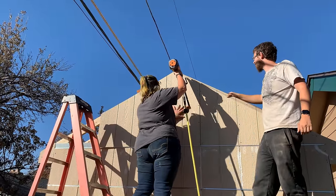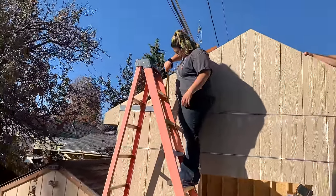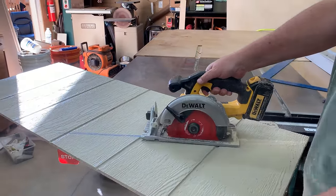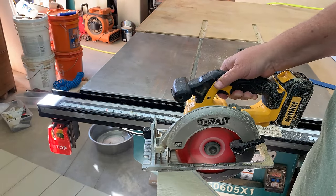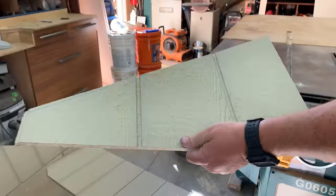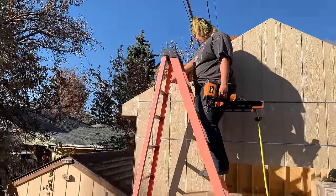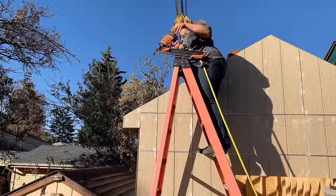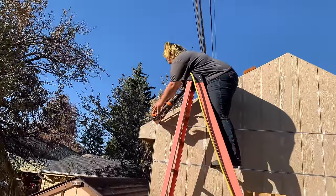Then we'll just install this piece with the same nailing schedule as before. Now that we've reached the other end, it's the same situation — two elevations, one attaching to the siding and one at the other side. We'll transfer those measurements to our board, take it inside, cut it, and put it up. I hope going over all these things in detail wasn't too boring — I wanted to point out the techniques because measuring to get these cuts to line up can be a little intimidating if you've never done it before.